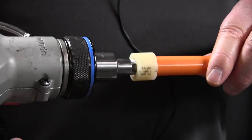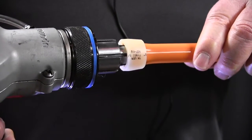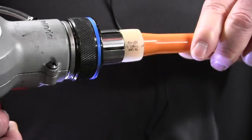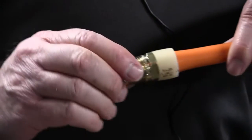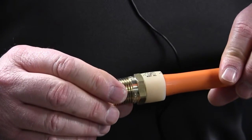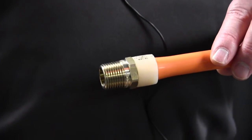So I'll put this in, pull the trigger and count: one, two, three, four, five, six, seven — then insert the fitting. You want to make sure the fitting bottoms out on the PEX ring. It's a nice tight fit and this will shrink right up. You can actually turn it still and you will not be able to pull it out — you can air test it right away and it will not leak.